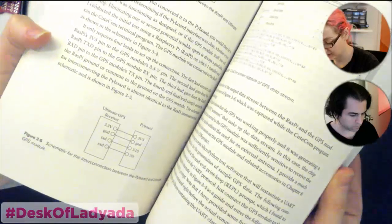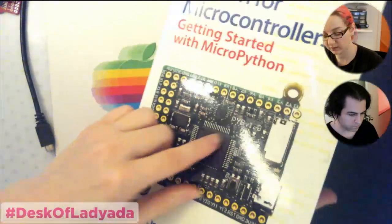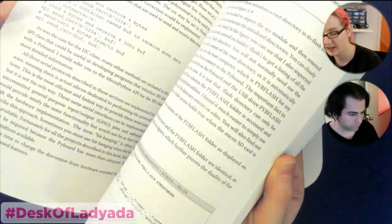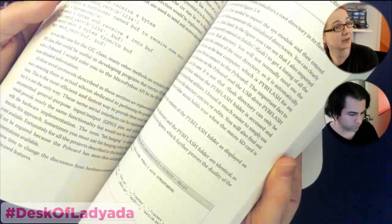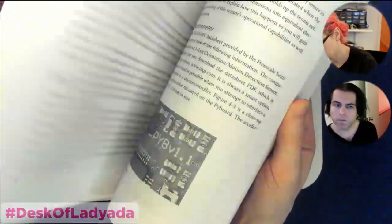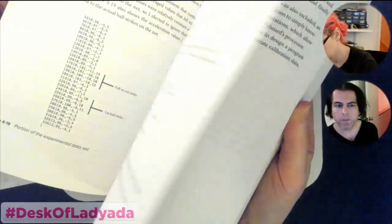It shows how easy it is to connect — like a GPS. The PyBoard, which is Damien George's board shown on the cover, came up with the idea of having mass storage where you store your files — we totally stole that idea. We decided not to go with an SD card and went with SPI flash instead. Turns out the cost of an SD card connector is about the same as an SPI flash chip — about 20 cents — so we just went straight SPI. We have the books on order; they'll be in the Adafruit store.